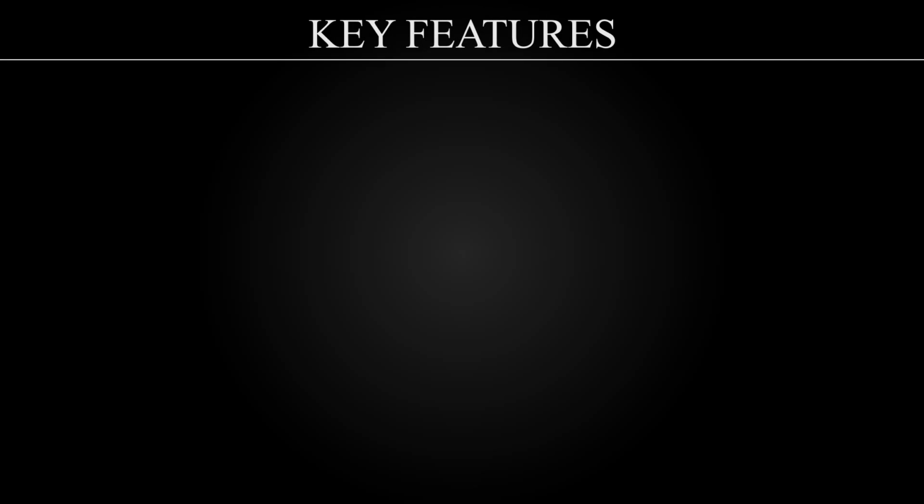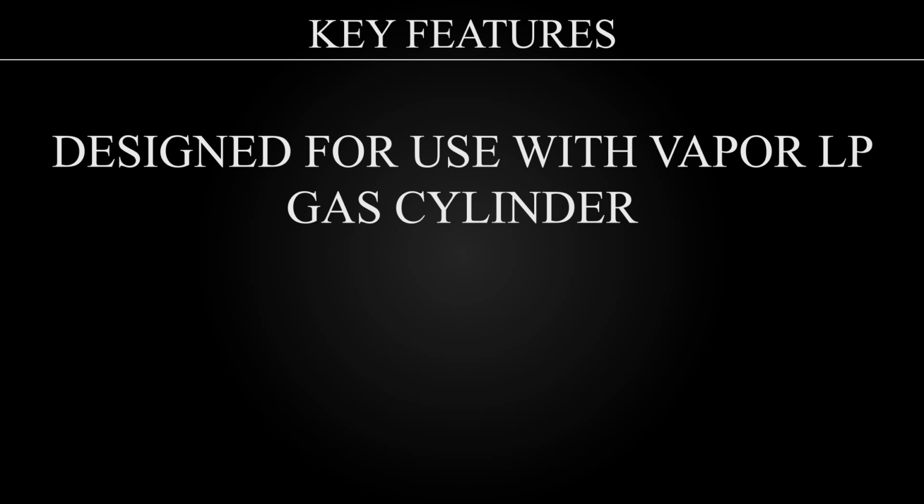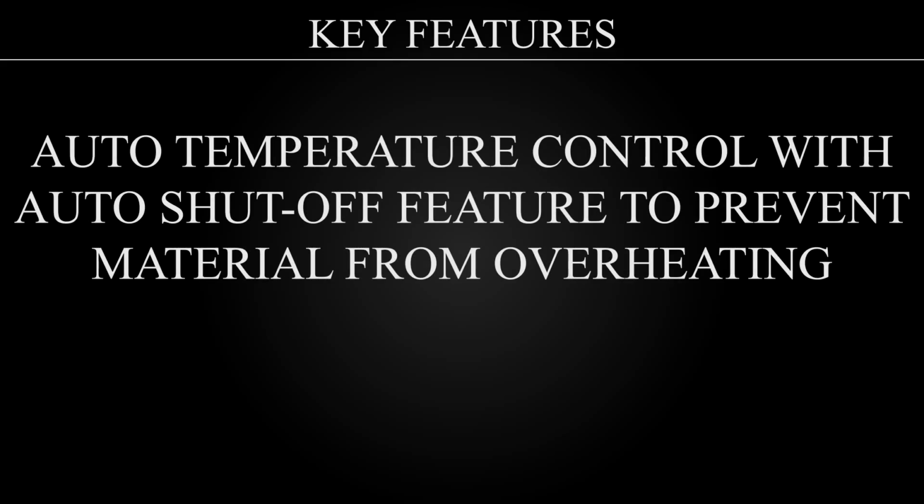Thanks for watching. Let's review the key features. This unit is a 125-gallon capacity direct fire gravity flow melter. It is ideally suited for Crackmaster Supreme direct fire hot pour crack sealant and designed for use with vapor LP gas. Automatic temperature control with automatic shutoff feature to prevent material from overheating. Hydraulically driven direct drive full sweep agitation with forward and reverse that guarantees even, consistent material heating and mixing.